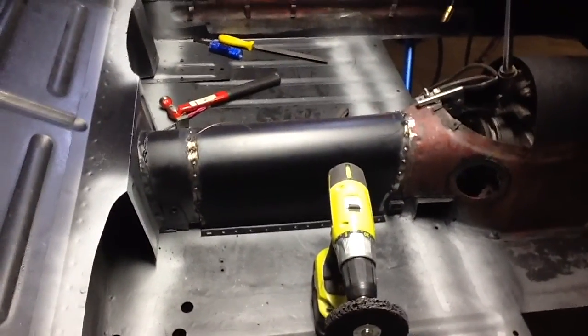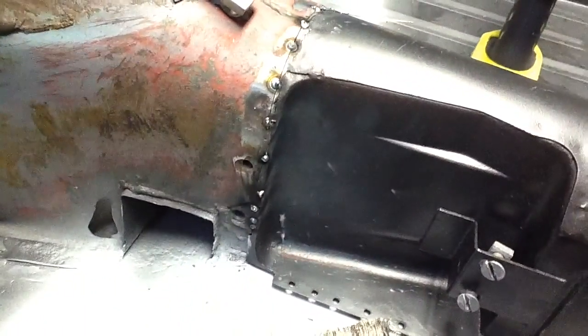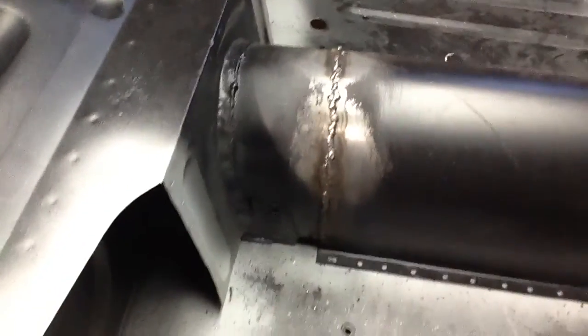I got it in — it's all tacked up, so it's just a matter of going around and welding it up. It all fits nice. The trick would be welding it up without burning it through. I got all the stitch welding done around the front and back, both sides. I had a little bit of blow-through problems up in here, but nothing catastrophic that I couldn't fix fairly quickly.